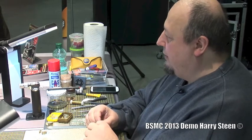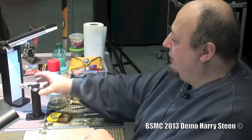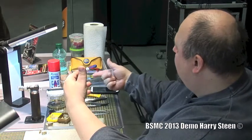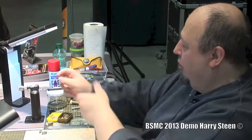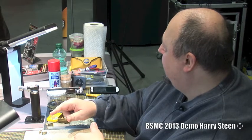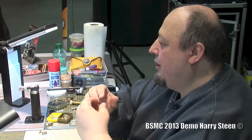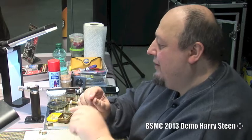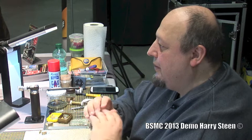The effect about the butter and the oxidization you also get with a soldering iron sometimes. Another advantage of using a torch is that a soldering iron needs to be on the table with cables and it's on all the time — you waste a lot of energy. And the heat on the tip will make the tip oxidize over time, so you always have to take care of the tip, clean it, maybe put some flux on it, maybe re-tin it.